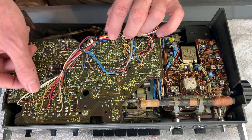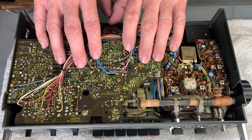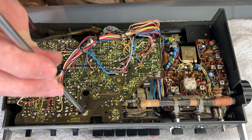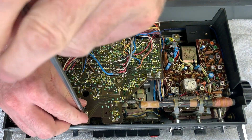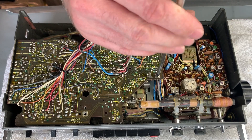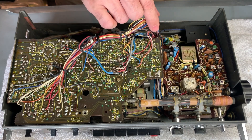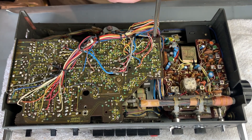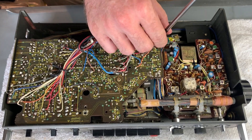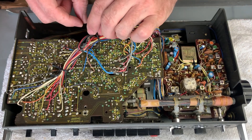There are a couple of things to do at this juncture, including desoldering the two cables from the APSS light and unscrewing the screws from the board to access the mech. We'll get the screws out first - you've got a machine screw with a washer here, another one on the corner, a further screw on this corner, and the fourth one is actually holding the cable tie. We'll get the plastic ties away as well.